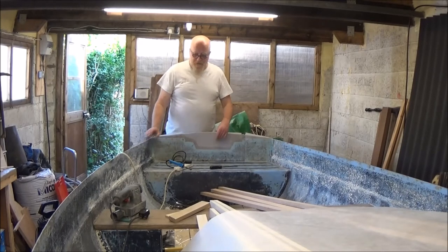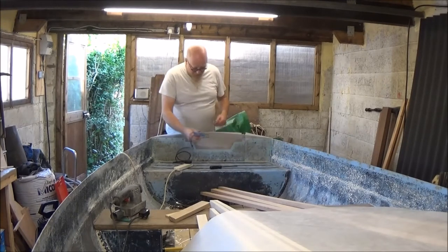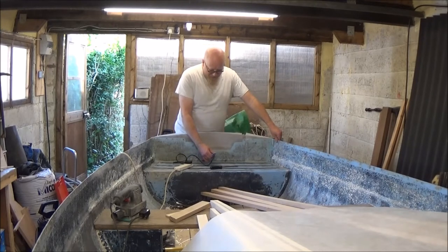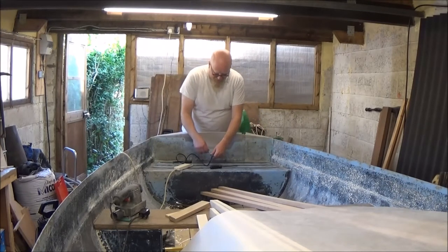The easy way of getting them out is with a soldering iron. I've taken the tip out and it's warmed up now. You place the end of the heating iron part straight onto the screw head — the heat should transfer through and melt the glue slightly so you can take it out. It's one of those things some people might not realise, but a bit of heat — and in some cases steam, especially for wood — can take apart pretty much any glue. The only one that claims not to be is Cascamite, a powdered glue mixed with water used in boat building for a long time before modern glues came in.